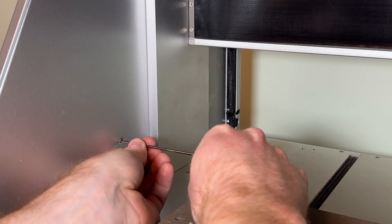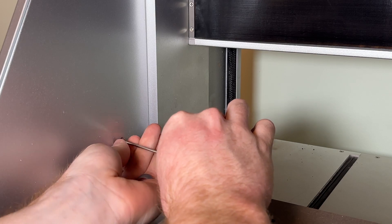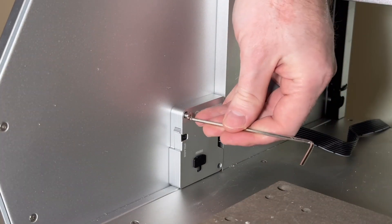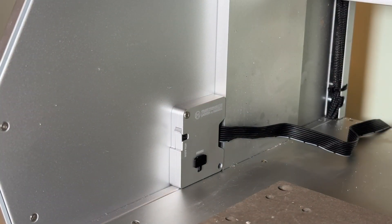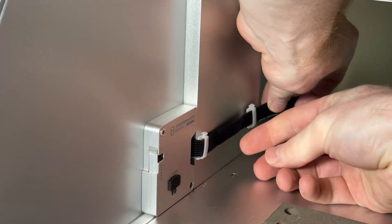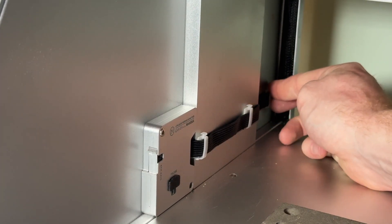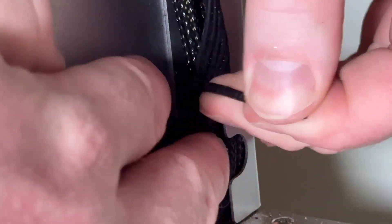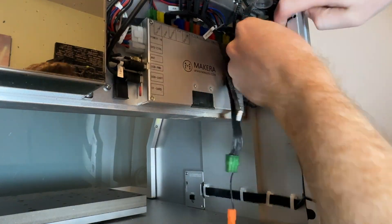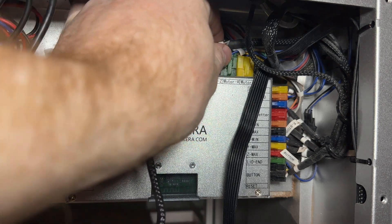Working from the inside of the machine, install the wiring adapter as shown in the user manual. First, remove the existing screw holding the left side panel on the lower left side of the machine. Using this open screw hole, install and secure the wiring adapter with the longer M4 by 20 screw included in the kit. Use the wiring clips included to route the wiring harness towards the rear of the machine along the side panel, ensuring the wires are taut so they will not catch on the dust bin when reinstalled. Using the cable ties provided, route the wiring adapter harness up towards the rear of the controller board following the existing wires in the rear left corner.